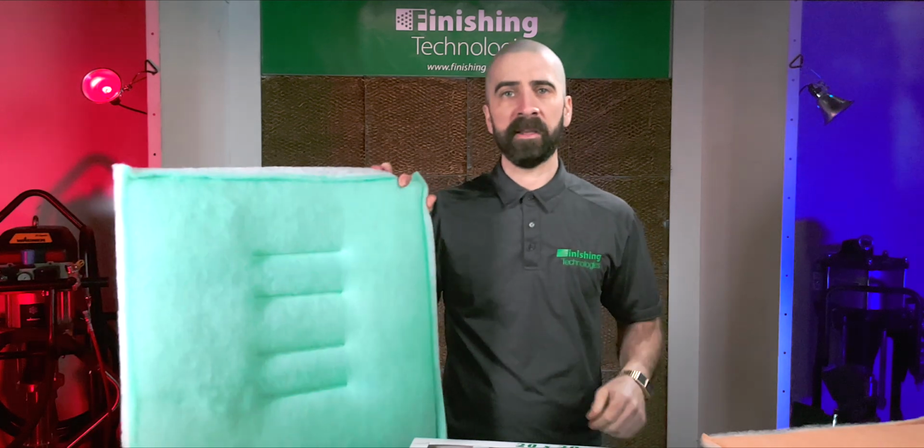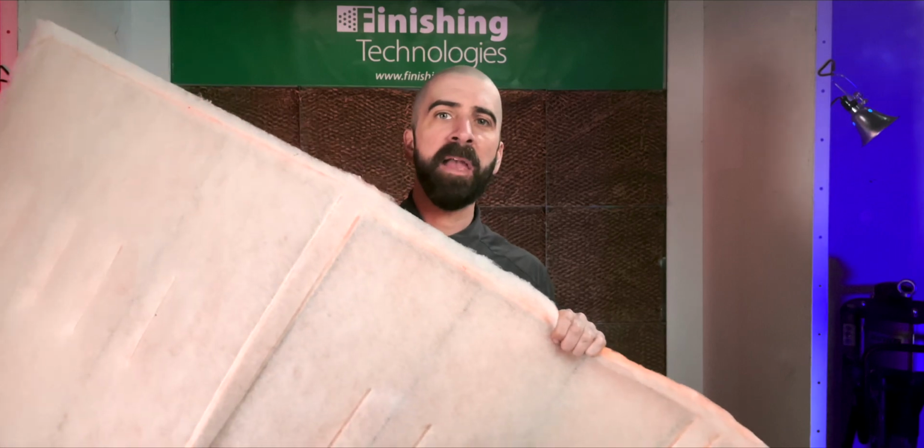Further, since the media is sealed around the outside of this frame, this creates a pliable flap around the perimeter, which gives these panels a self-sealing feature, ensuring that 100% of the air gets filtered. Even if panels are butted up together, this feature directs the air through the filter, so you don't have to tape them together. Further, both the SL3 and SL5 filters are available in links, which can be handy for several reasons.